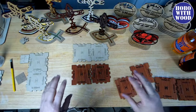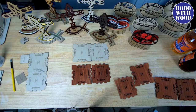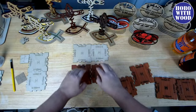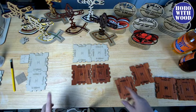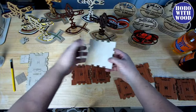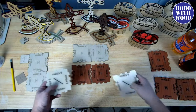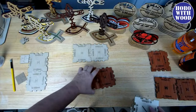So your material is going to change. That's what Chris was saying earlier. Even if you get your kerf dialed in on your laser from one material to the next, and from one laser to the next, it's going to be completely different. So this one is a completely different test. And let's see here. 0.12 is what worked on the birch.